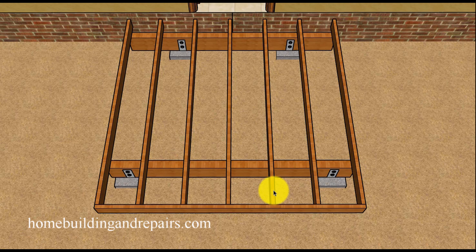You need to check with the manufacturer if you're going to be using any type of engineered materials for your decking. For regular construction standard lumber — redwood, something like that — two foot spacing is fine. I've seen it plenty of times. But sometimes by simply adding another joist or laying it out and centering the joist with certain lengths of your deck can be beneficial. And that's the main reason why I'm going to make this video.